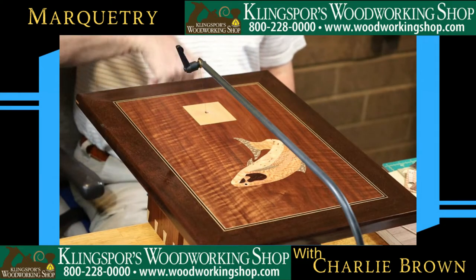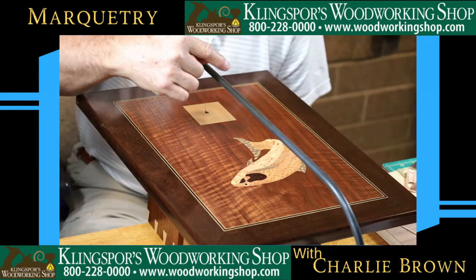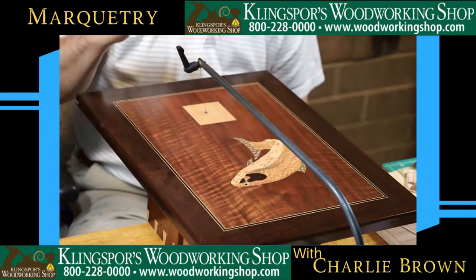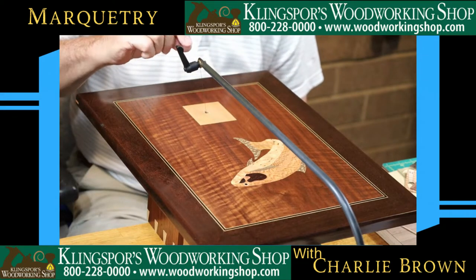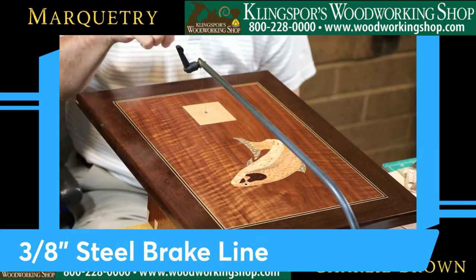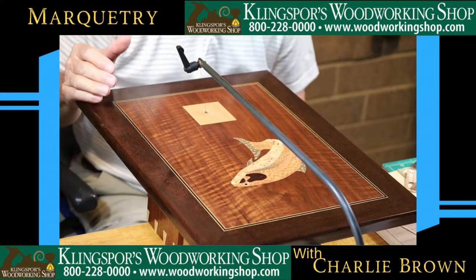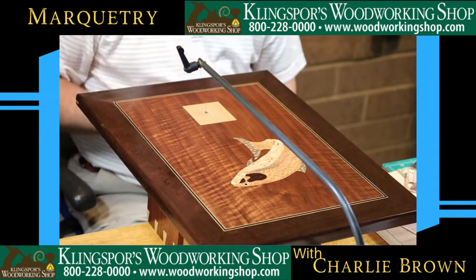The materials for the saw, I mentioned the drawer slide, the spring, the little handle, most of it's hand cut stuff. The tubing here is 3/8-inch steel brake line. So you buy that at the auto parts store, and then you have to figure out how to bend it without kinking. And there's some tips on that at various places. There's a keeper up here that holds your tiny saw blade. Details of that are in this plan I'm going to reference here in a few minutes. So it's not an easy piece to build. It requires a fairly well-equipped shop to do it, and some woodworking as well as some metalworking to thread connections.